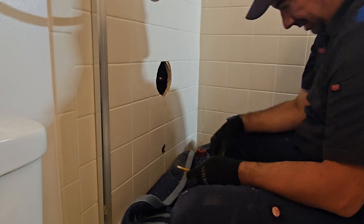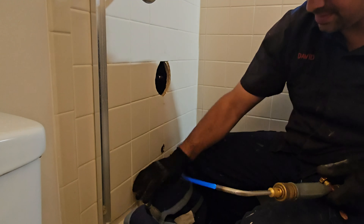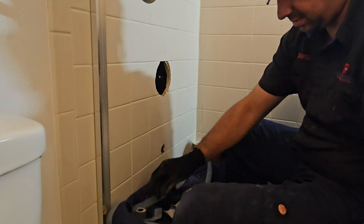Guys, take the handheld off the hook — that plastic Home Depot shower head does hurt. After that little mini concussion I had to move on because we needed to turn the water back on for the homeowner. I got the handheld out of the way and kept on going. The hardest part on these jobs is trying to get the spout copper inside that wall, so that's the first thing I always tackle.